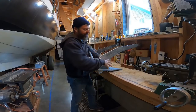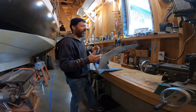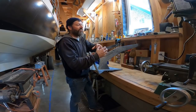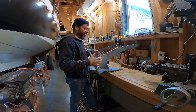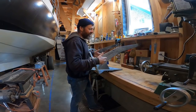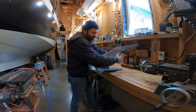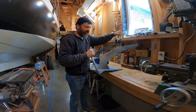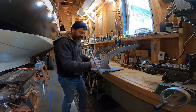Now, the transition between this blob of seabed here and the rest of the seabed was broken. The seabed is a semi-solid in these two mud seabeds that I was testing, and there is at least some strength in the seabed itself. Once you've started moving the two with respect to each other, you've broken that bond, and holding power becomes much less. And I believe the front edge of the seabed, which is going to be turned up like this somewhat, might actually be helping raise the anchor and lift it up out of the seabed and drag even more. And that was all improved by my mods, because I think what I did allowed the seabed to keep moving through.